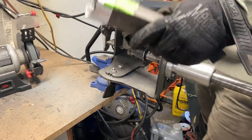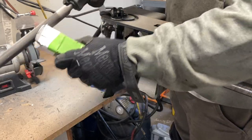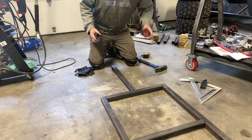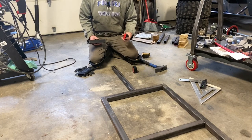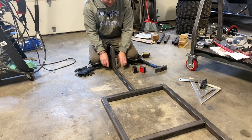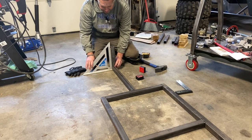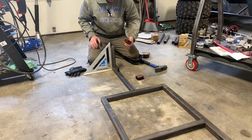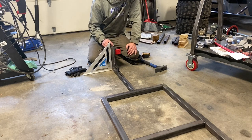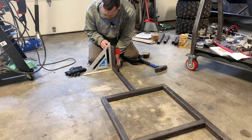The notcher is definitely going to leave some sharp edges, especially on this piece because of how it's cut. I'm not above using a hand file to just get rid of some of that. Now is our first introduction to magnetized angle finders. If you want to make your build easier — not necessarily more successful, it's going to be successful — but easier, you should invest in some of these. You can check it and get it tacked in, but these things I love. I can just tip it and have a live view of my exact angle while I'm tacking it in place, so I know it's going to be absolutely perfect.